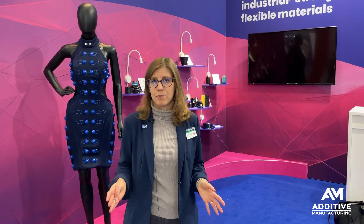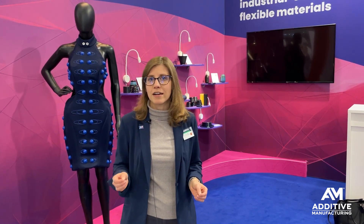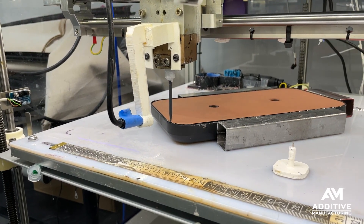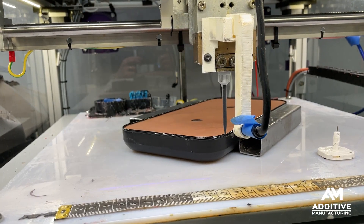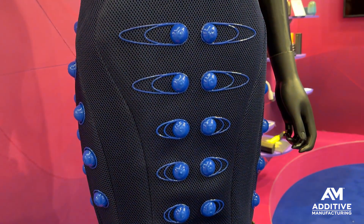Chromatic 3D is a 3D printing technology company that develops 3D printable polyurethanes and other thermoset elastomers for RXAM — reactive extrusion additive manufacturing. It's a deposition-style process that uses a chemical reaction rather than heat and melting to deposit and solidify material, so it can happen at room temperature. That means you can deposit this material directly onto textiles and other types of fabric.